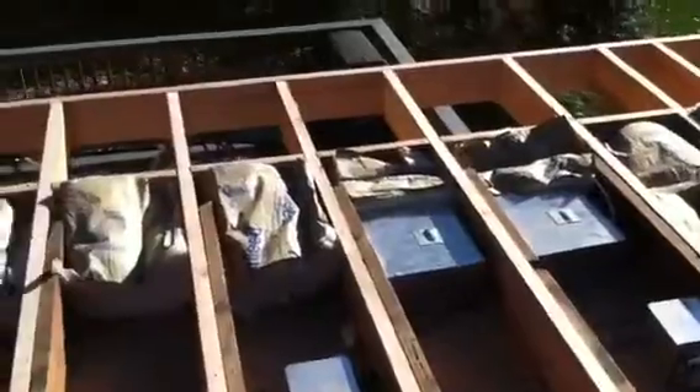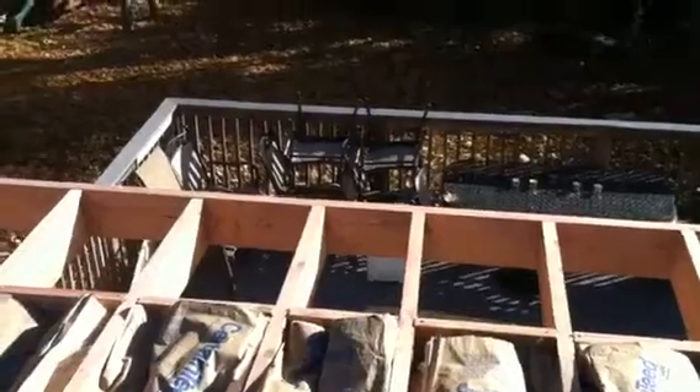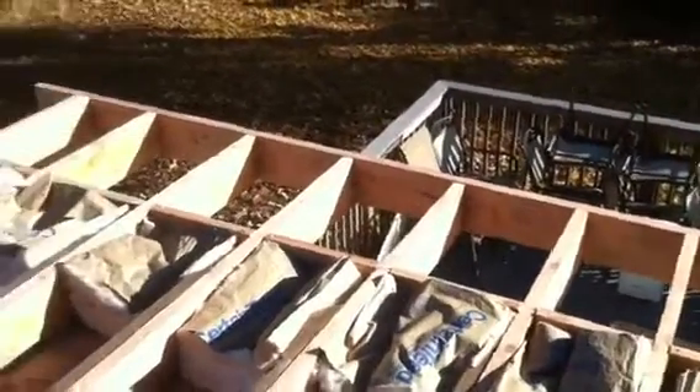Alright YouTube, you can see we're putting down the floor still, and now we're installing the insulation around the perimeter. This is an R30 insulation. The right way to install the insulation is to have the vapor barrier up with the paper.